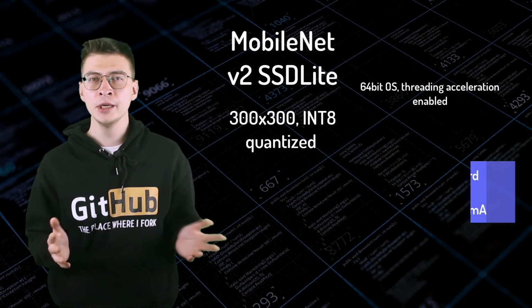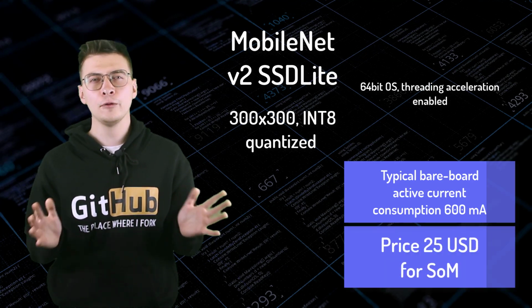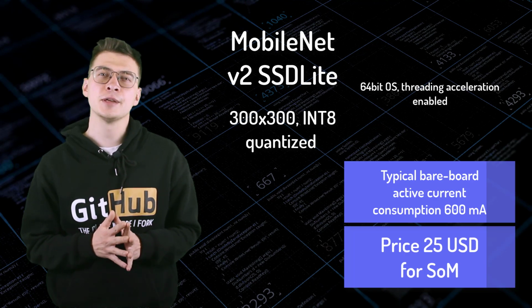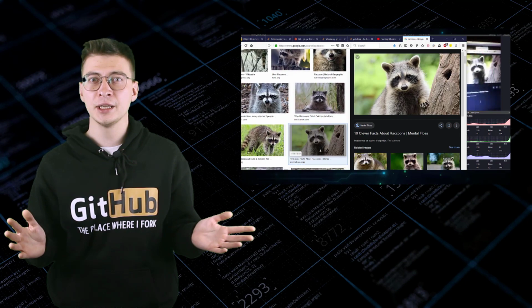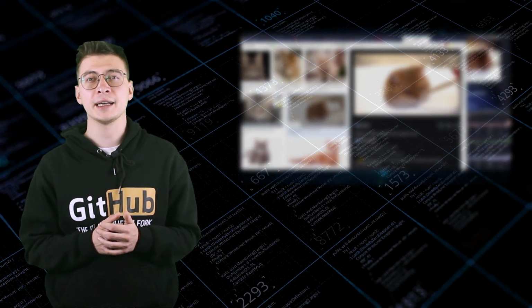It will consume close to maximum power while performing the inference on all 4 cores, and the cheapest you can get it is $25 for SoM. MAIX-I, on the other hand, easily processes 320 by 240 video stream with MobileNet object detection network at around 15 to 17 frames per second.